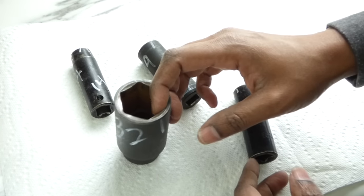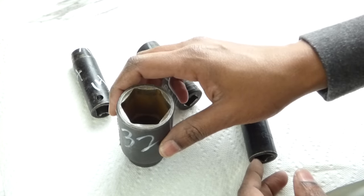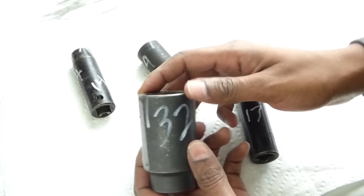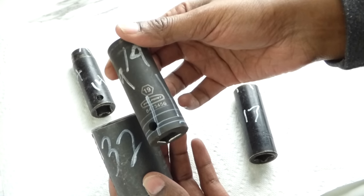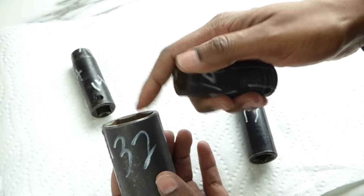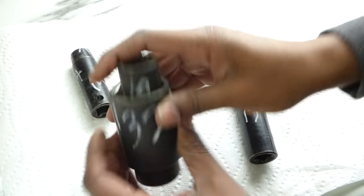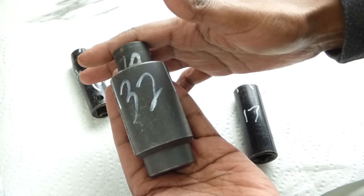The guy who came up with the heavyweight crank bolt socket is on YouTube, Chris Watson. You can check out his video here, or I'll put a link in the description. What he did, which a lot of people don't know, is he took a 19 millimeter, stuck it in an axle nut socket, welded all around, and that's how he came up with the heavyweight crank bolt socket.